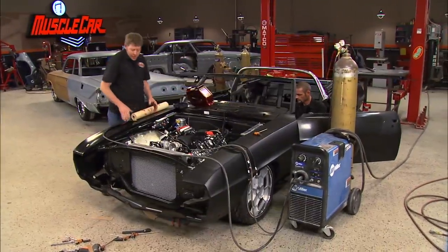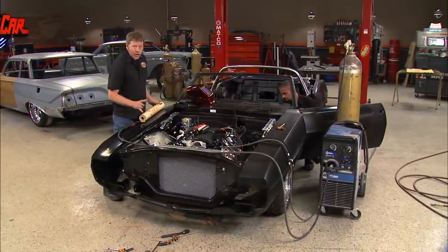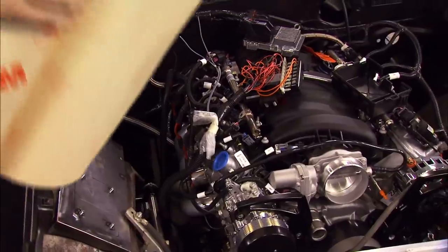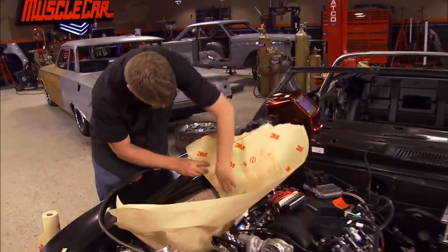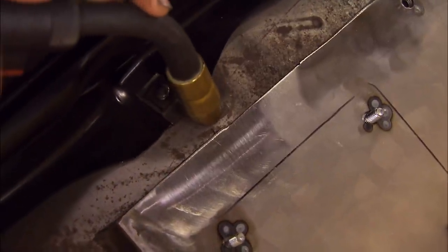We're back. I've got my mounting panel ready to get welded in, but at this point I do not want to cover the engine compartment with welding spatters — so here's a little tip: welding paper. It's sticky-back paper that's been treated with a flame-retardant coating. You can stick it over glass, body panels, or anything else you don't want to burn. It's kind of expensive, but it's cheaper than fixing all the damage you could cause if you don't use it.